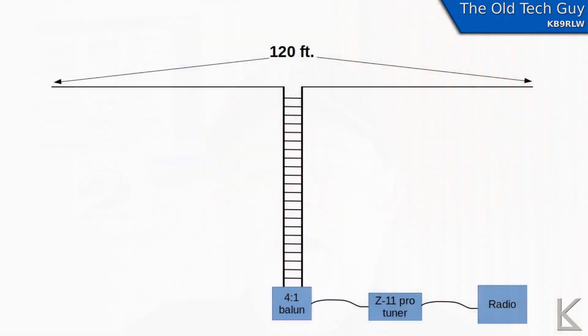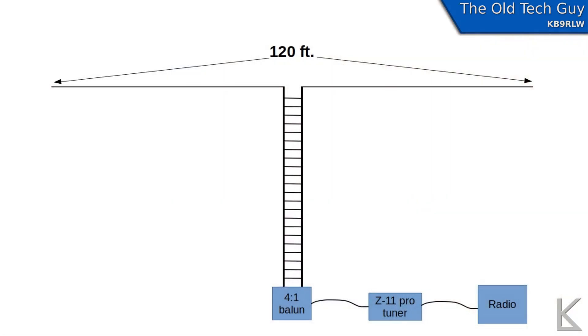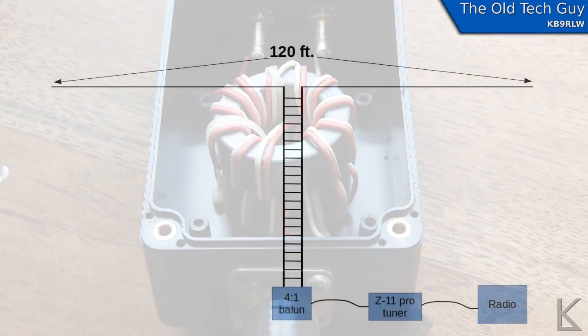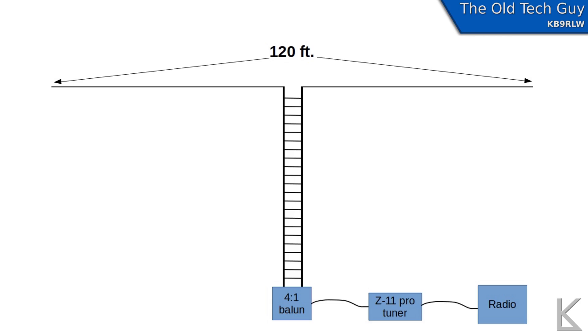The doublet design — real simple antenna. Here's a picture of my design, which is about as basic as you can get. It's fed with a parallel feeder, a window line in my case, or you can use ladder line. It's basically a dipole, it's symmetrical, both of the antenna elements are exactly the same length — down to the inch. There's a 4-to-1 balun that I built that's at the end of it, and then a short piece of coax comes into my LDG Z11 Pro tuner, and from there through an SWR meter to my radio.